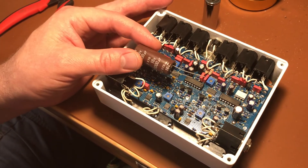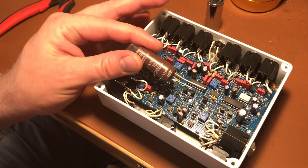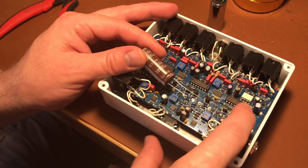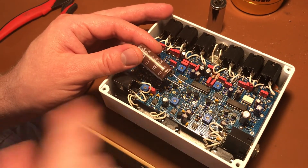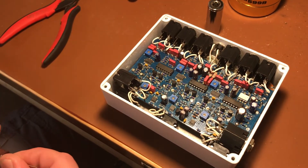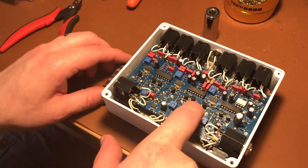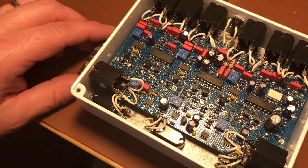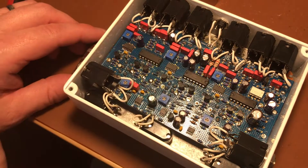So in comes this 10 millifarad — or 10,000 microfarad — capacitor. We're not going to replace the original one, but we are going to add this in parallel to its connections at a different place in the circuit. That will greatly increase the capacitance and make it more of a true virtual ground for our application. We're also going to replace a couple of resistors — one in each of the loops — which will reduce the overall crosstalk even further.